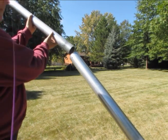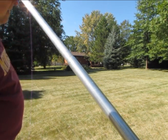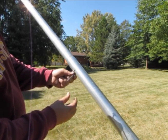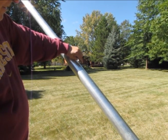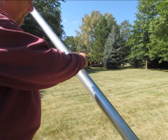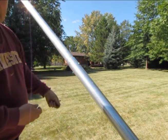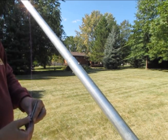We simply place the tube in the hole, pull out the hardware — there's a stainless steel washer, a three-and-a-quarter-inch bolt. The trick will be to find the hole on the other side, of course. There we go. And another washer and a cap nut. I'm just going to put that on loosely for now because I have to put anti-seize compound on there as well, since these are also stainless steel nuts and bolts.